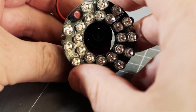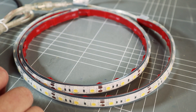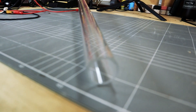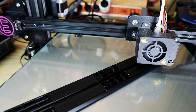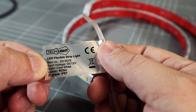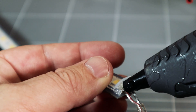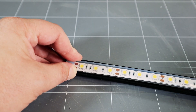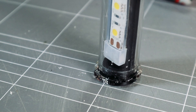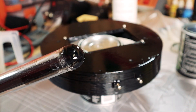A lighting system on the camera itself wasn't going to work and infrared was not the way to go. I needed lots of light, and I love LED strips. Using 25mm acrylic tube that was destined for another project, I printed some fittings to hold the lights, which the manufacturer rated as kind of waterproof — until I cut them. A bit of hot glue will sort that out. I printed these on a glass bed so the self-adhesive stuck well, then some more 3D printed fittings, a stick of hot glue and a splash of polyester resin, and these things would want to be waterproof.